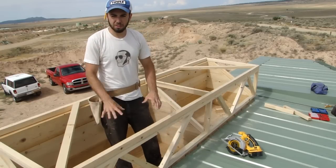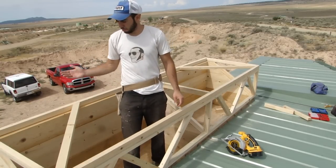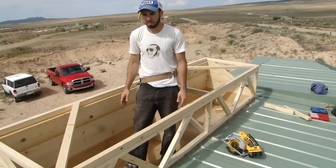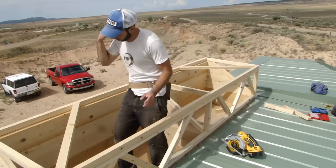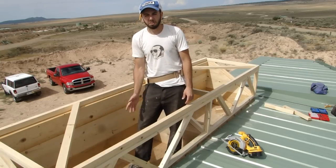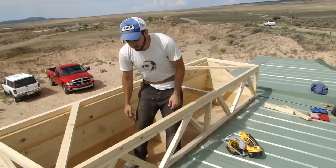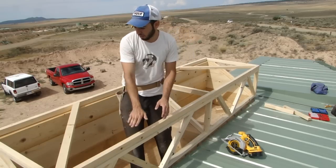You can see here, this is the systems box. I have opted to split the box in a 45. You can see there is a 45-degree angle that splits the lid of the box and the base of the box. The reason I'm doing that is because the inverter and the load center need to have 30 inches of clearance. They need to be mounted on a vertical wall, and they need 30 inches of clearance going this way towards the north. Unfortunately, our box is not that big.